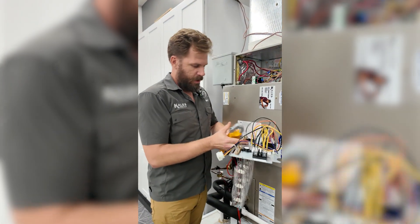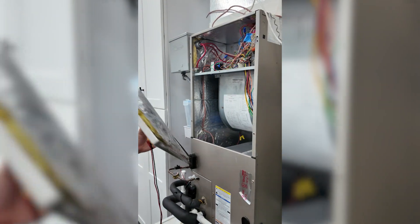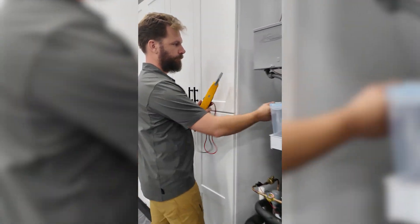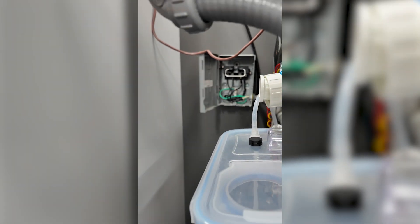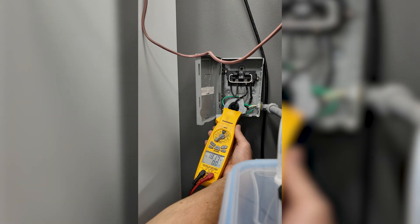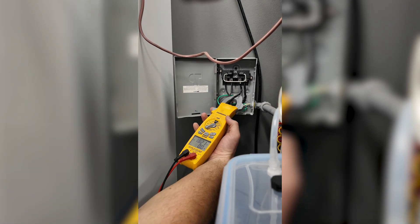When you have the unit open, typically I'm holding the panel in place so I get my blower running at its normal amps. Another trick is to put your panel back on and come over to the disconnect box or breaker panel nearby — you could also check main amps there. I can put my meter on and see 18 amps, and I know that my 5K heater is working.